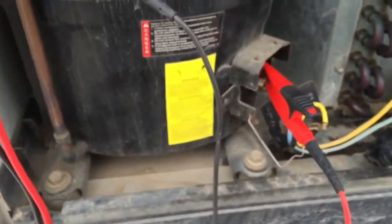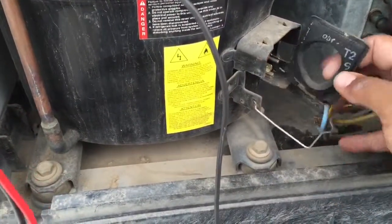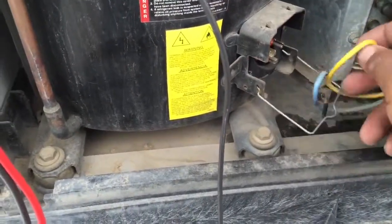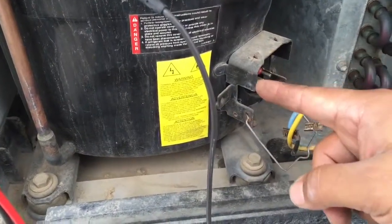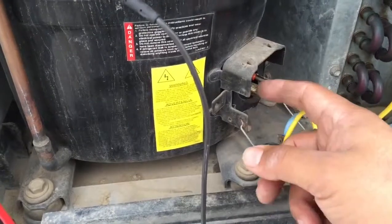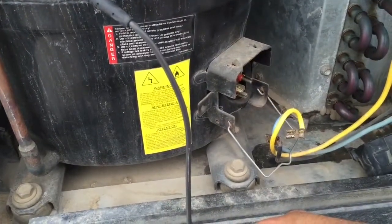So we're okay, I'm going to go ahead and log that. You guys want to be careful when measuring or removing any of these leads here, because you can have a terminal blowout — that's the weakest point of the compressor right there. So be careful when you're removing those if they're corroded; don't attempt to remove them.